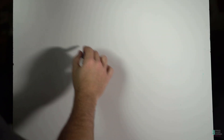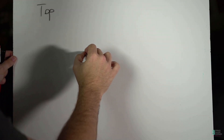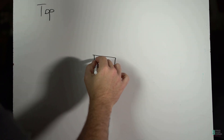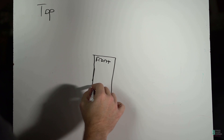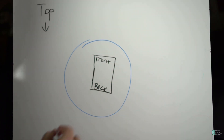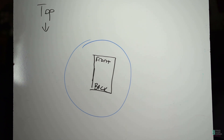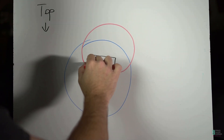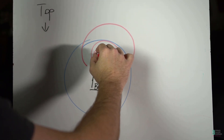In most speakers, what you have is a 360-degree pattern. Let me draw this out to make it easier. Looking at a standard speaker from a bird's-eye view: with low frequencies, the sound is omnidirectional because the wavelength is much longer than the drive unit. With high frequencies, the sound becomes more directional — and the higher you go, the more directional you get. By the time you get to 10 or 20 kHz, you're basically firing in a narrow sweet spot.